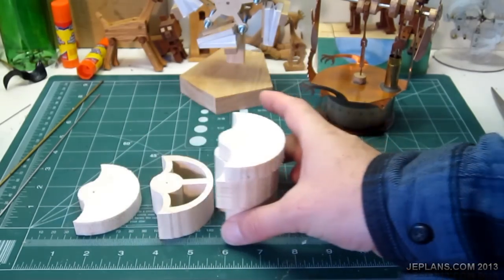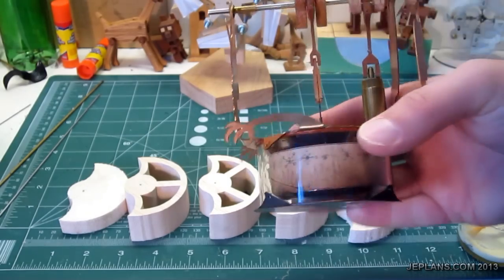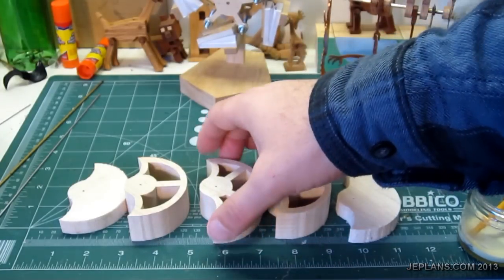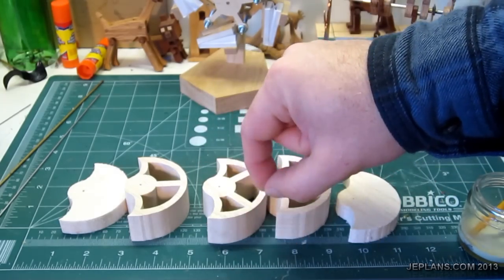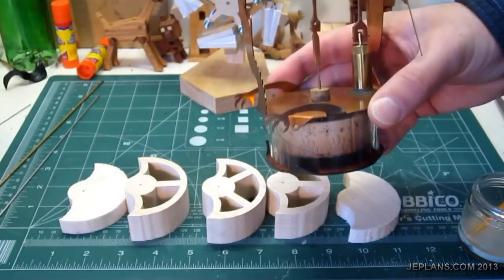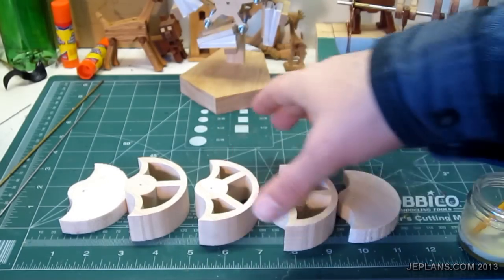I just wanted to take a second to talk about my previous displacers. Like in the Phoenix engine, they're all basically hollow paper displacers. One of the things I'm trying to achieve here is making it so that air cannot freely move from inside and outside the internal portion of the displacer. Where the paper ones aren't rigid, these are rigid. I'm going to seal the inside grain with a little glue.